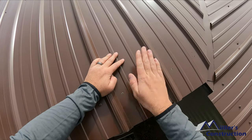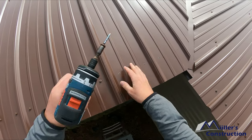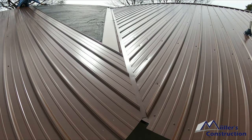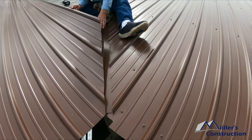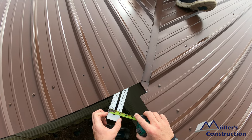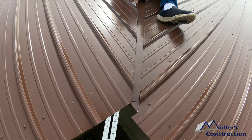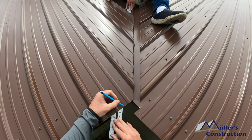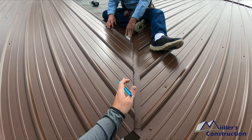Let me get this fastened down here. Let me put some of this on top — keep that from shifting. Now, something to note: it's a T-square, it's two inches wide. Two inches of a gap from the center to the edge looks the best in our opinion — that's just personal preference basically. He's at the top making a tick mark. Now I'm at the bottom, so I know that the middle of my rib — the edge of it's on this side — so I need a mark on this side. All that's got to come out now.